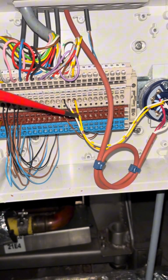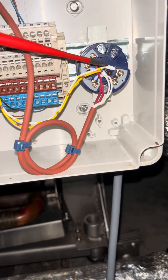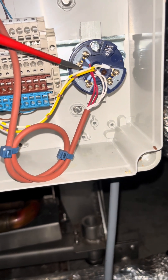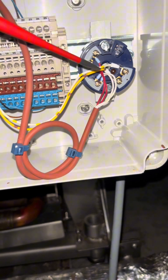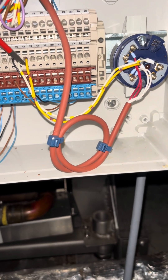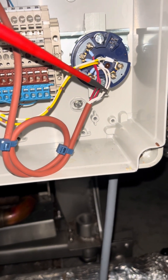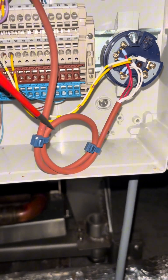Now this is a two-wire powered loop — it's a 24-volt feed, but it's feeding back the 4 to 20 milliamps as you can see going back on the yellow and purple cable. The other cable going into it is the PT100 with red and white cables. You can do thermocouples into these but you've got to configure them slightly differently.